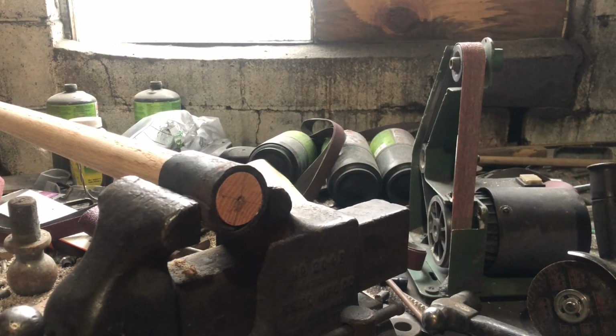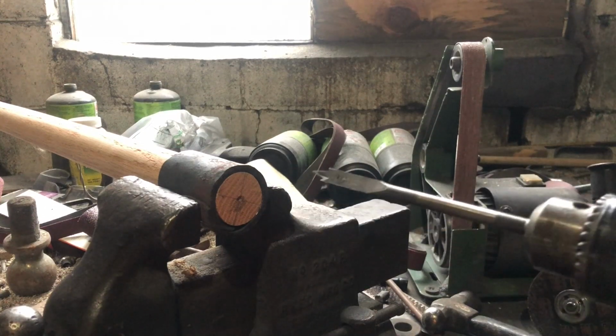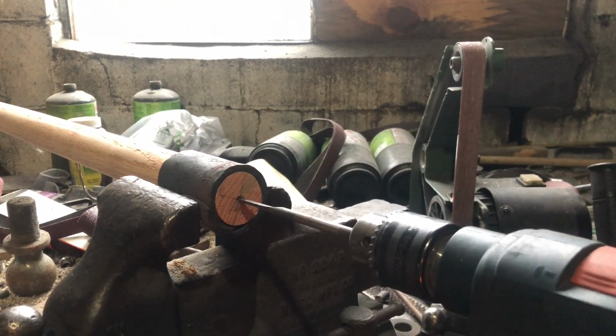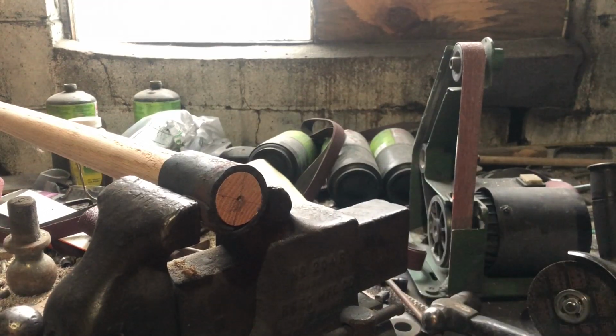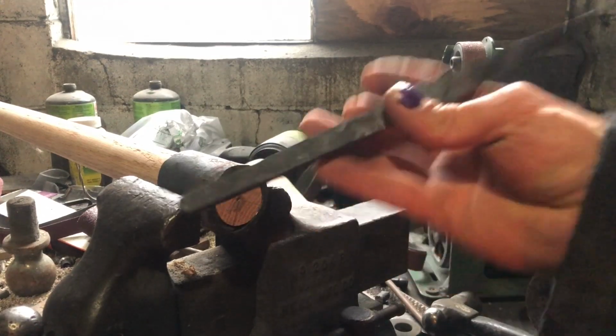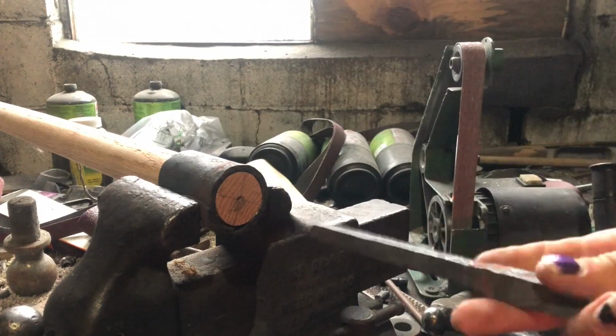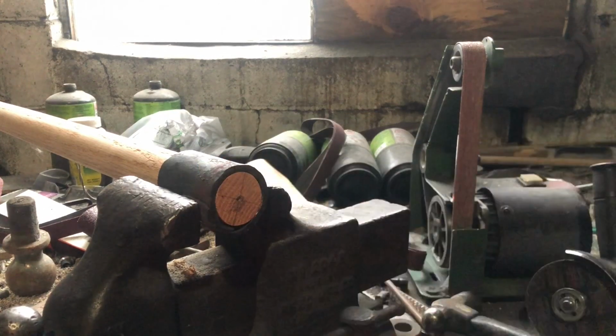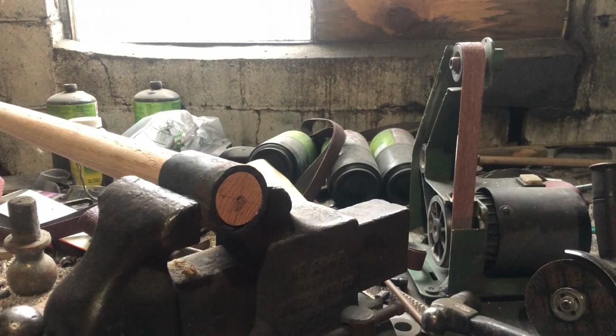But now what I'm gonna do is just take a regular drill, got a nice 3/8 drill bit. Gonna drill my hole as close to straight as I can. And then once that's done, I'm gonna burn square with the spike, and then heat treat and temper this. Cut out a little slot on the metal cap, and of course make sure it fits on here perfectly so I can epoxy and pin everything together.